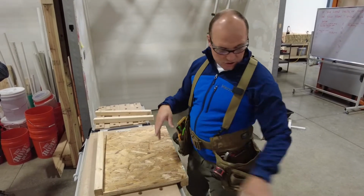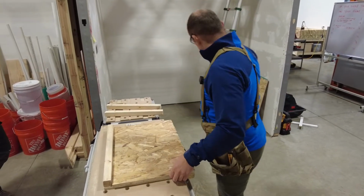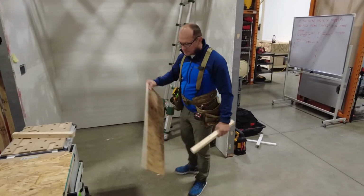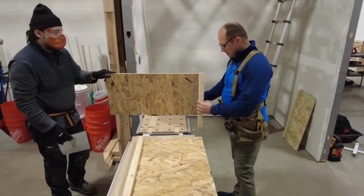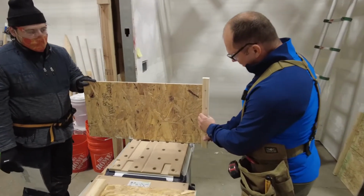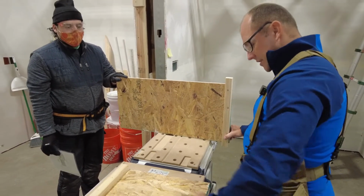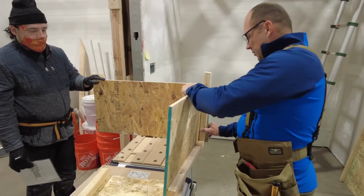When you do that, I'll show you, you have to have a square or it won't work, okay? Somebody might say, well, you have these long sides, you're going to put them in. Can you hold that for me? Right, we have this, right? I know it's 25 and a half. Why don't I put one here, and I measure over 25 and a half and I put one in there, right? So then when I put this up in the attic, it's just perfect, right?